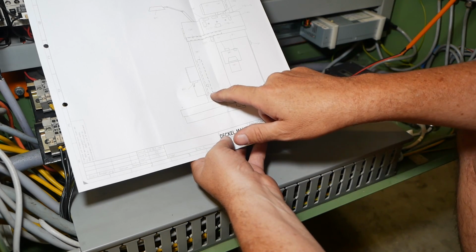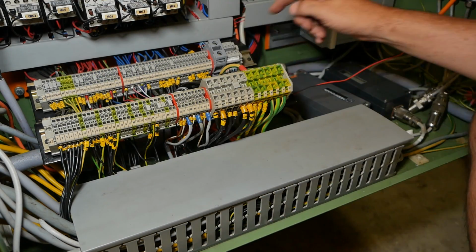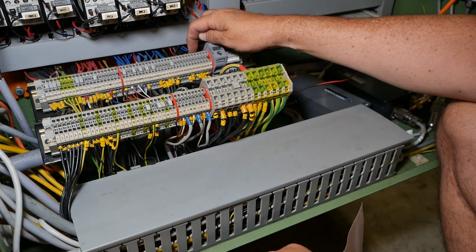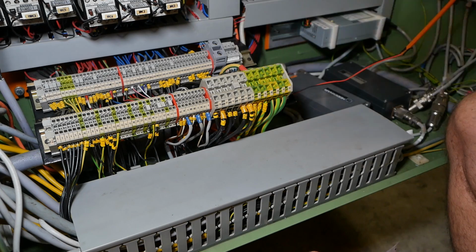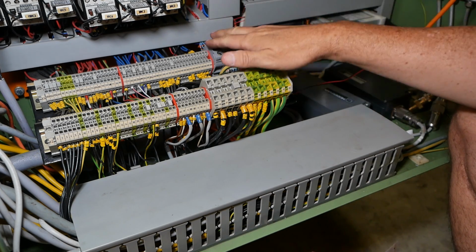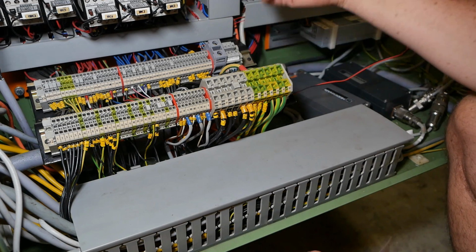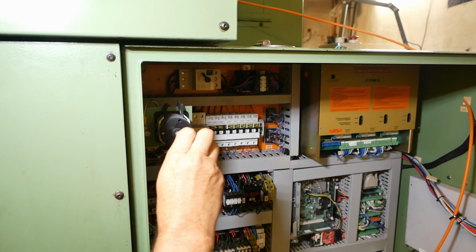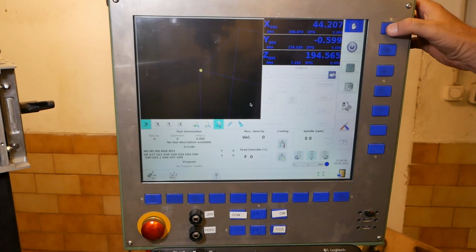What I'm going to do, I'll just jump a 265 to 267, which will then allow me to release e-stop. I'll very carefully back the machine up off the e-stop, and once it's back into its normal range, shut it down again and remove the bridge. My guess is doing this in an industrial environment will get you marched off the site.